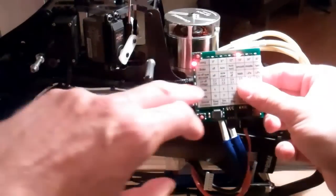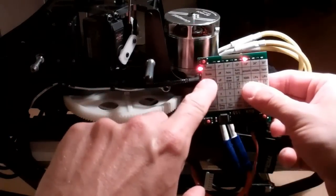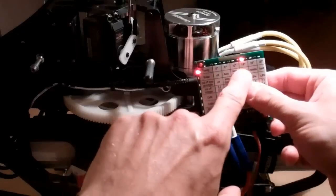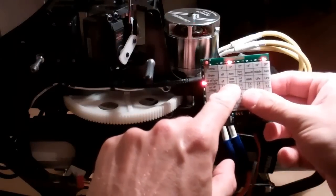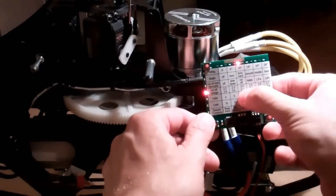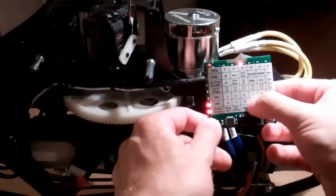And I'm just going to have a quick look at the numbers here, this is what it's going to show. On my motor, and this is definitely particular to your motor, timing is 18 degrees. Brake is off. The cutoff is slow and LiPo. Cutoff voltage was 3.1. Number of cells is 12.